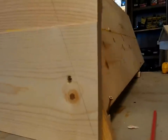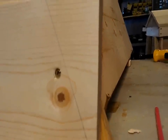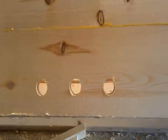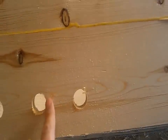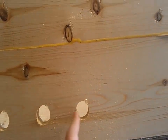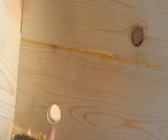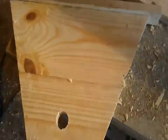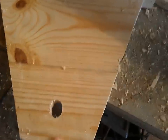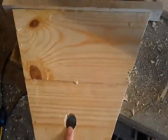That piece just needs to be bigger than the 15 inches when it's on an angle — whatever angle you make those floaters, which are the triangles inside, is the angle you want. Once that's all together, drill your holes for your bees. Find the middle of your side piece, which is 44 inches long. Go two inches up and then three inches to either side of that hole, and three inches from the end piece. Create five one-inch holes. Then take one of your top bar floaters, go two inches up from the bottom, center it, and drill a hole so the bees can get to the sugar water.